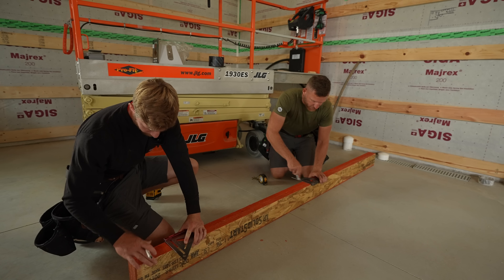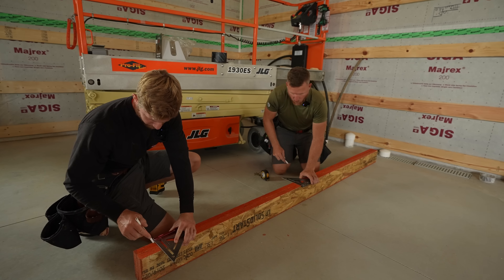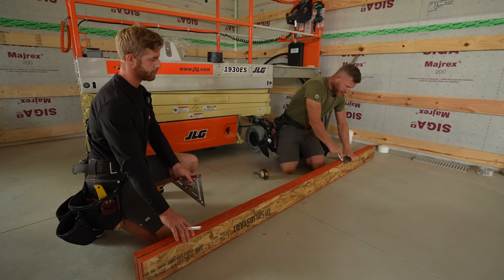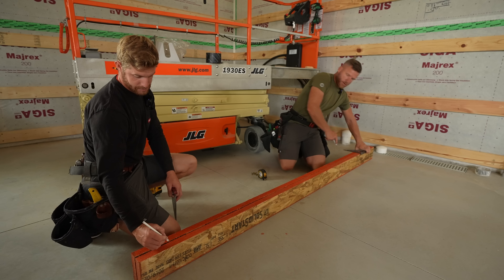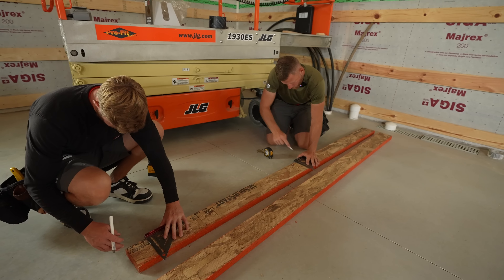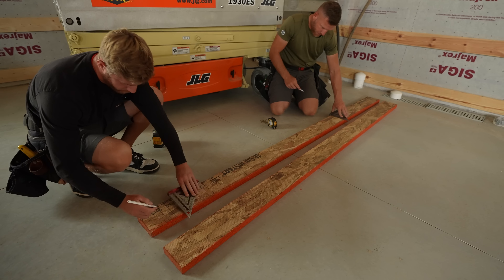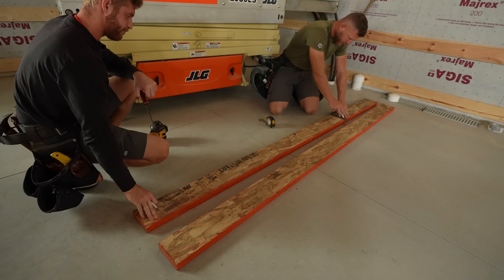There's really no reason to use LSL for this unless you're going to do some tall walls, kitchen walls, or bathroom walls where you want really flat studs — like if you're doing level five drywall work, which we are not. But we're just using it up, so what the heck. LSLs are hard and dense as crap — nails do not like to go into them.